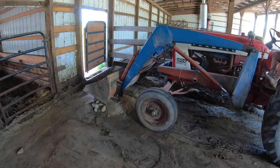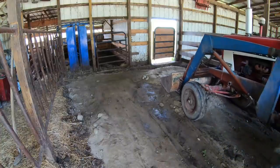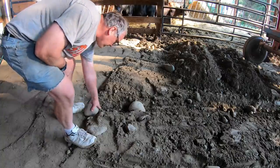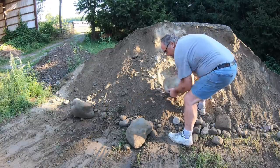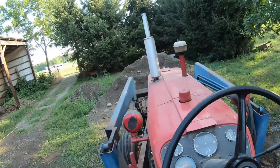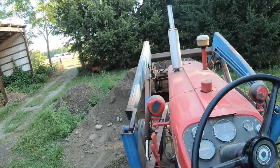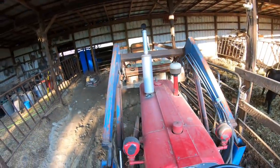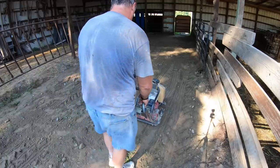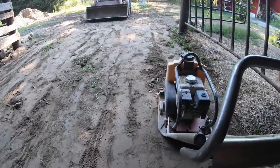Then it's just a matter of repeating the process — adding layers and compacting the gravel between each. The big stones in the bank run wound up being a big pain. I either had to pull them out and put them to the side, or dump them in the deepest areas of the fill, because the loader kept catching on them. If I were to do this again, I would use a material called New York State DOT Item 4, which is a sieve-graded mix of fines to coarse without any of those giant stones in it. It's a little more money, but it would have been worth it in terms of the hassle.